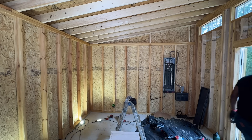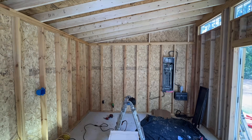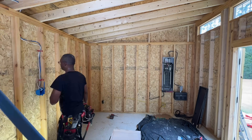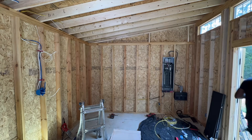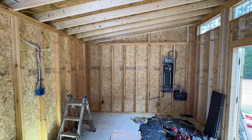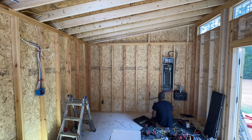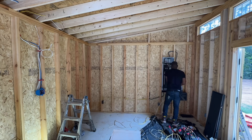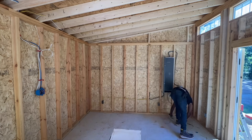Along the way we're going to wire a few more circuits — this is just my office, so we're doing a few multi-gang boxes for light switches, some interior and exterior light circuits, and a couple of outlet circuits. That's before I run my mini-split system, which requires another 240 volt circuit. Once I insulate this space, I can start to heat and cool it.